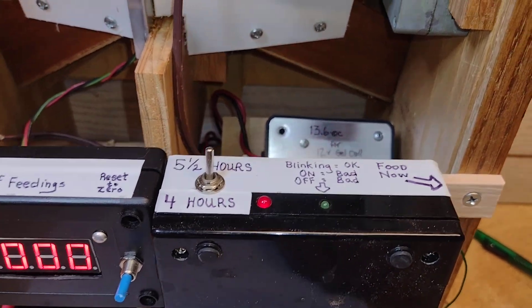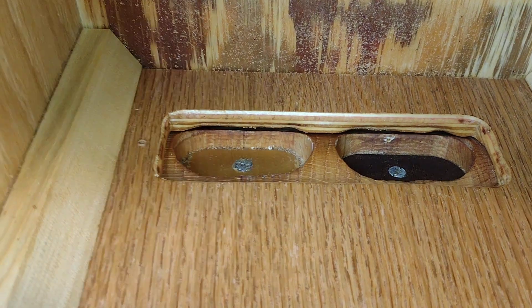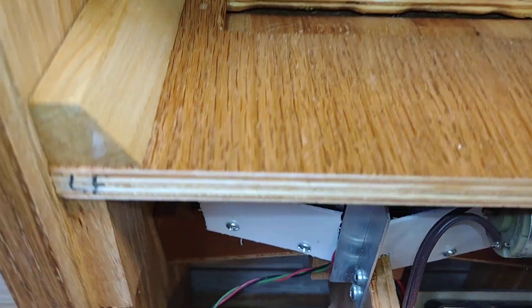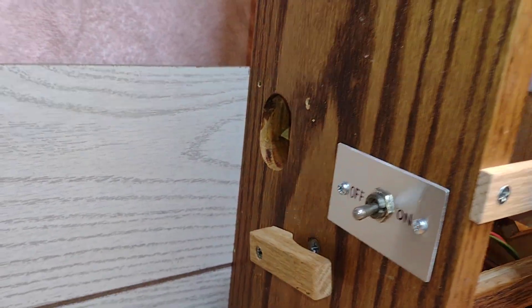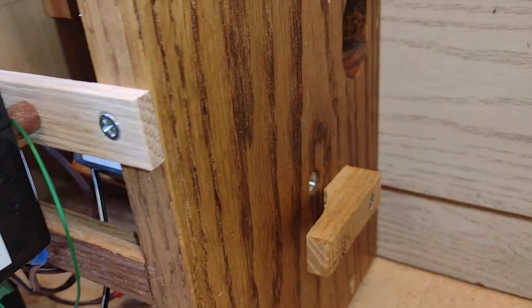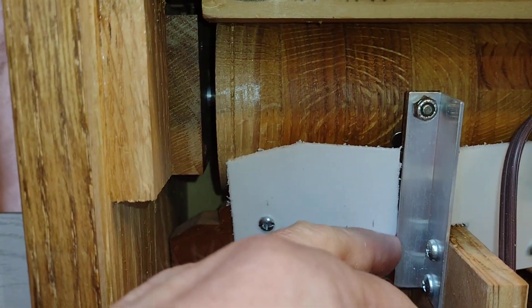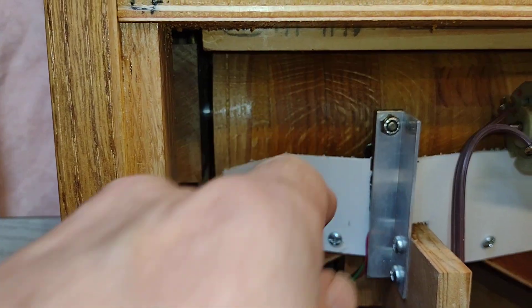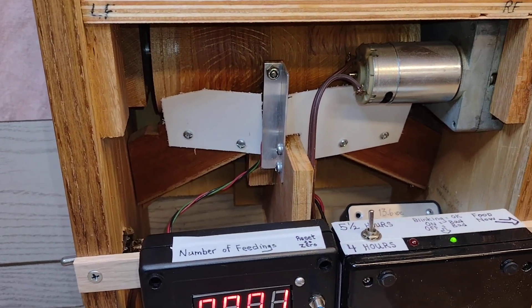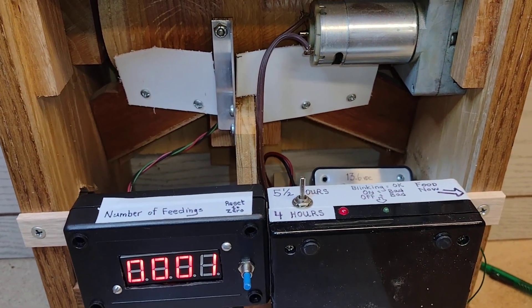Let's give you a quick overview of how it works — we're going to press the button. The food will come out of holes on each side and drop into cat bowls mounted on each side. It comes back around to the top and stops, because of a Hall effect sensor under my finger, which senses a magnet on the drum. So it makes one revolution, senses the magnet, stops, and then counts up another 8,196 counts, and then it feeds again.